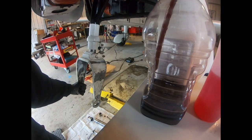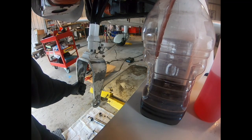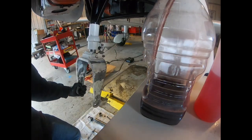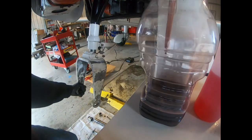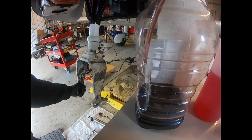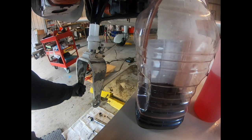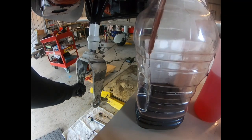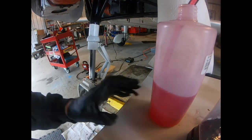You can see the fluid is starting to be considerably cleaner now. This is like the third rinse. Each time going between, we just try to drain as much as we can out of the tube so all the dirty stuff's in the bin. This last little bit out of there, and then the final time we're going to extend the strut once, let that draw all that clean fluid in,